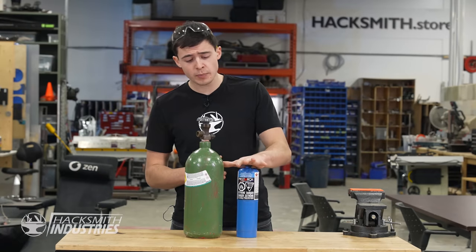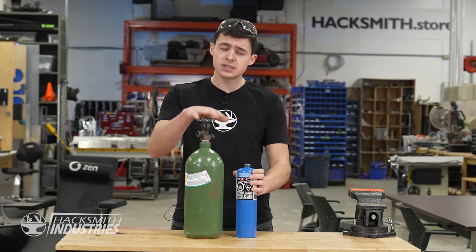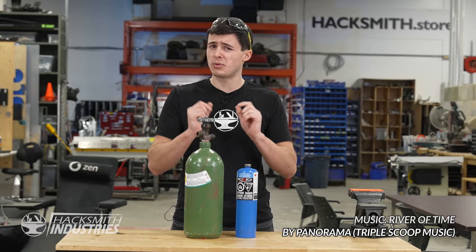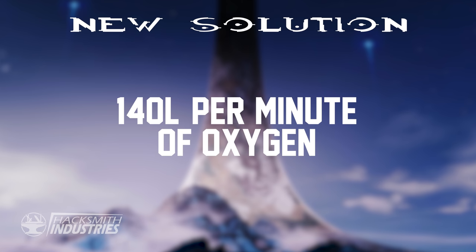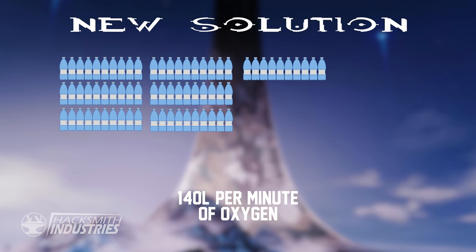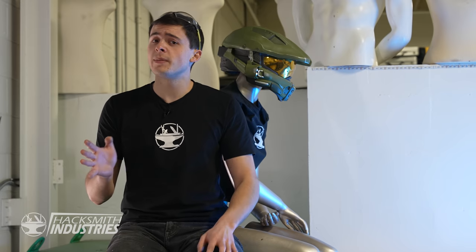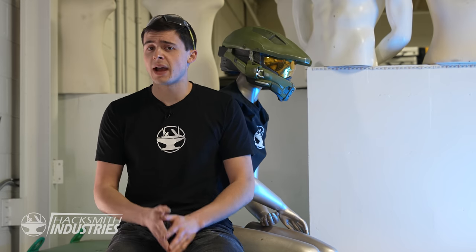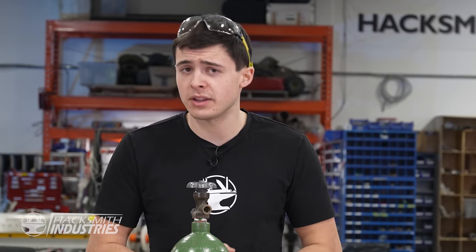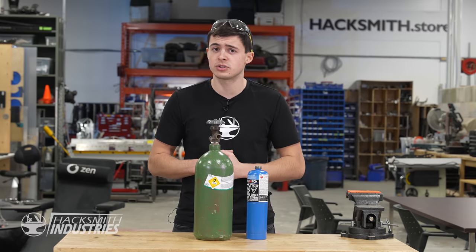For the lightsaber, we used propane and oxygen. We chose propane because it's stored liquid, so we can get away with a smaller tank and fit it onto a backpack. Those two tanks lasted us about 8 minutes. But for the Halo Energy Sword, we're using 4 nozzles, so we'll need a little bit more gas. We're going to need a different solution, because we're going to be using 140 liters a minute of oxygen — that's equivalent to 70 two-liter pop bottles. Not to mention, we also need an additional 40 liters a minute of fuel — that's an additional 20 two-liter bottles. And even though we buy our gases in compressed tanks, it's still too much for a backpack. The Halo Energy Sword is going to need a tether. And if we're going to have a tether, we might as well use a fuel that will give us the most energy, and for us, that's hydrogen.